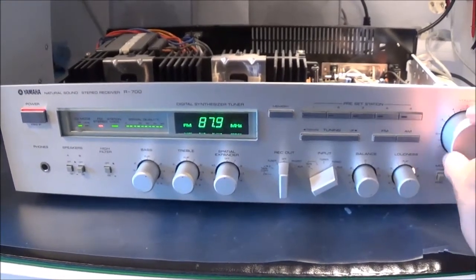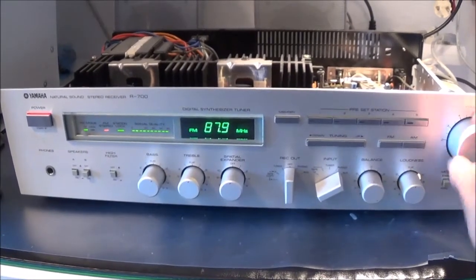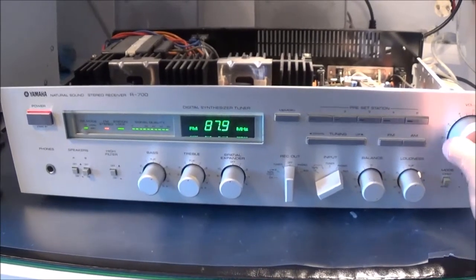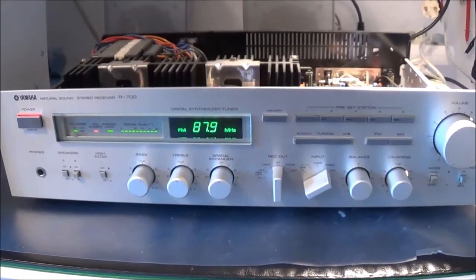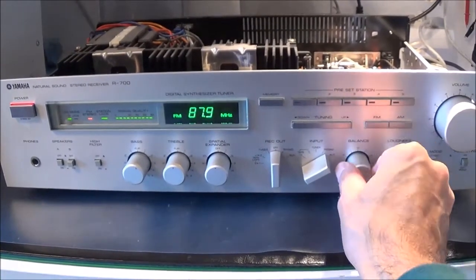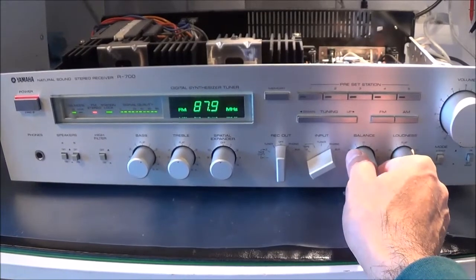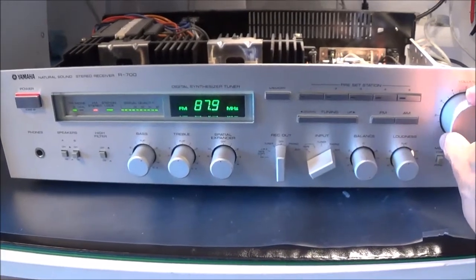I don't want to have to take this thing all the way apart, which could be a hassle. I might have to take this potentiometer apart. I can barely hear a teeny tiny bit of noise. I sprayed some contact cleaner into that volume control. I didn't have any problems with the left speaker; it was just the right speaker. So I'm putting the balance on the right, with the function switch in the aux position, and I'm going to play with this now.